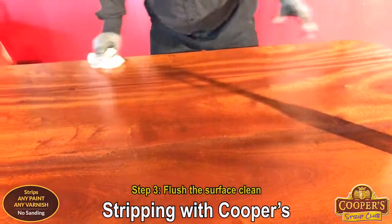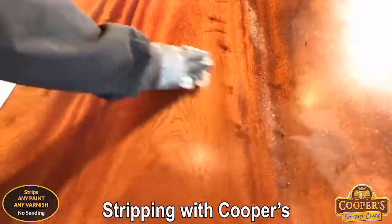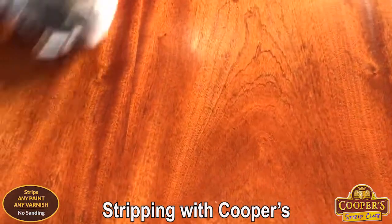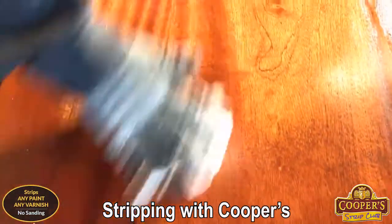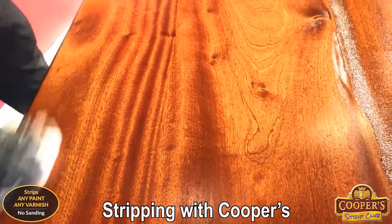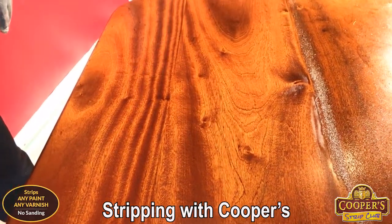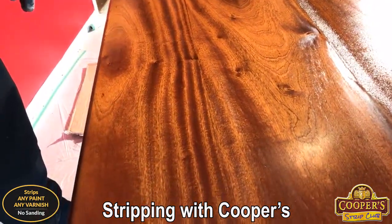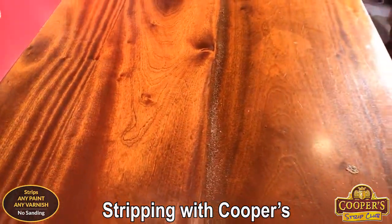And that is it. In about half an hour this will have dried. The rinse will have evaporated off and it will come out quite a pale colour. It's really important that you don't look at a blemish and suddenly think you better do a bit of sanding just in case — you'll cause a problem and you'll need to sand the whole piece. If it looks good wet, then that's to be trusted.